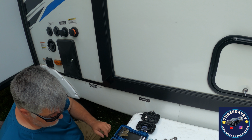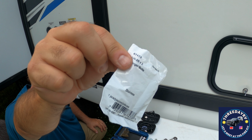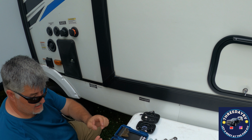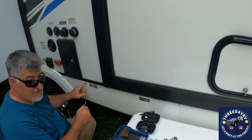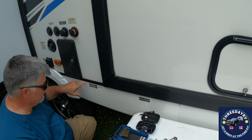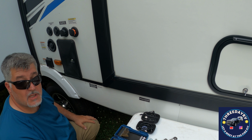I believe I got these at Lowe's. So a pretty cool little fastener. We're going to drill a pilot hole, and then we're going to put double nuts on the threaded side, and we're going to drive this in about 3/4 of an inch, actually right into the metal, or I guess it's aluminum frame slash wood that's behind this. And again, it's just a spot to hang, but we're going to put silicone in these holes so we don't get any water where it doesn't belong.